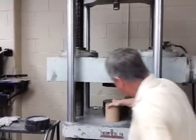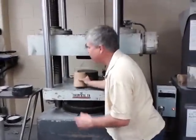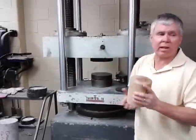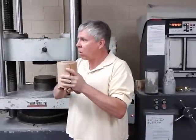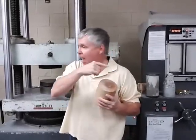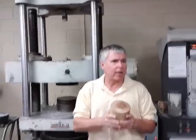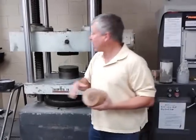Why don't I just put this down here and have this come down to here? What does this plate do? It levels it, it keeps it flush. I don't want this going from here to here because what if this surface is not exactly parallel? So that's what this thing does — it takes another error into account. Even in the capping thing, if that capping rig isn't perfectly perpendicular, there could be an error. Whoever manufactured that capping jig — is it 90.000 degrees? No, it's not. That's why we have this thing here.